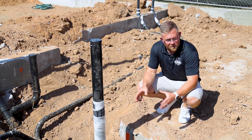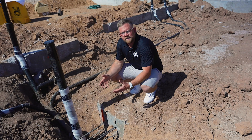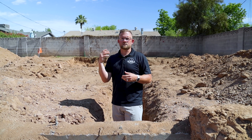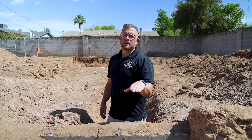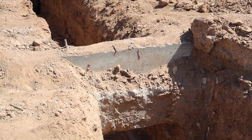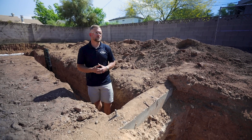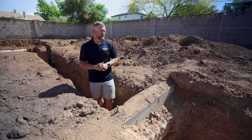Doing this allows our plumber to easily move throughout his day to accomplish the task at hand, which in a house this size is usually about three days to get to a point where we can have inspection. When discussing underground plumbing with our trade partners, we try to minimize the overall amount of runs necessary, which is specifically why we deal with box outs. The minimum slope is a quarter inch but it would be better to get closer to a half inch to ensure all waste exits to the exterior sewer tap.